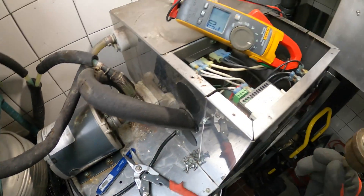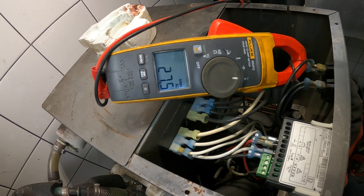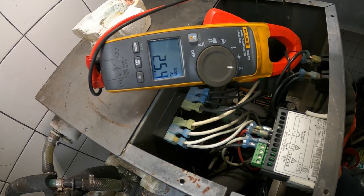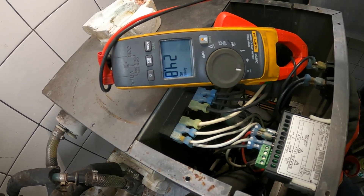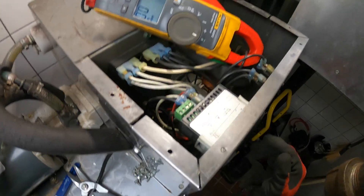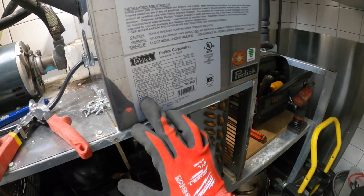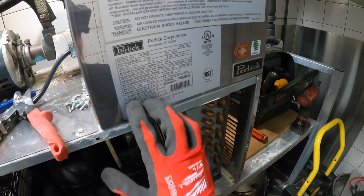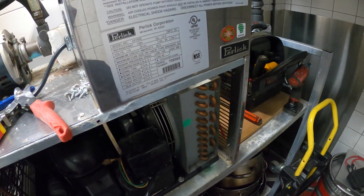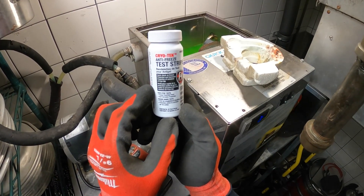I think this thing has cooled down a little — let's try turning it back on. We got 27 amps, 26 amps — and it's going to shut off on thermal overload, right there. Just as I suspected. The pump motor full load amps nameplate is 6.1 amps. You already know that thing is locked rotor — I think it's done.